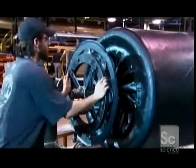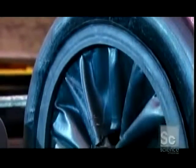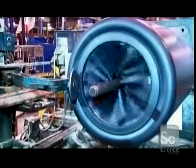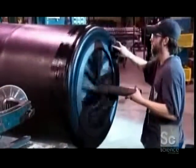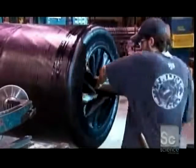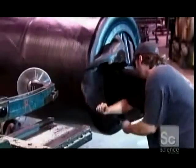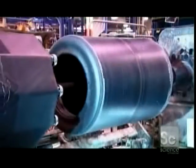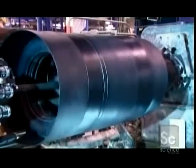Using a special applicator wheel, they push the bead against the lip of the rubber tire shape. The bead adheres, but it needs to be more solidly attached. A spinning disc forces the bead more firmly to the rubber tire shape. Then, the tire assembler folds back the extra rubber from the tire and wraps it around the bead, using sheer physical strength. They install 2 or 3 beads on each side of the tire. The multi-roller device takes over from the assembler and folds back extra rubber to lock the beads in place.